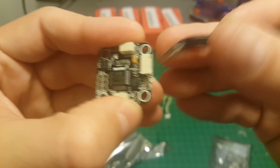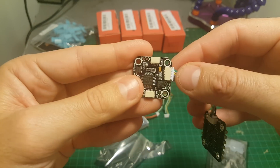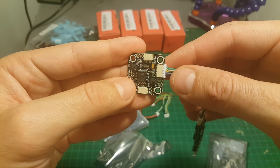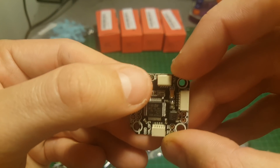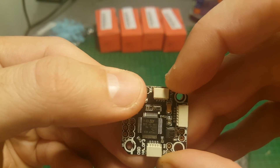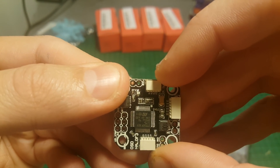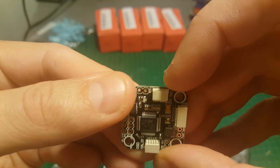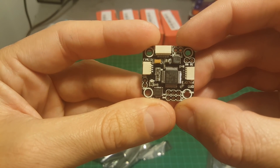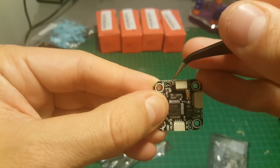Here is the connector that connects to the bottom plate of the motors — you simply have to connect it here and you're good to go. It is also going to power on the board. On the top we can find the OSD connector that powers a 5-volt camera, and you can use it for video in and video out so the OSD is overlaid on your video.